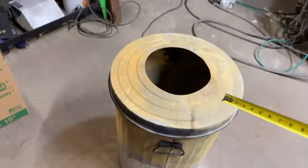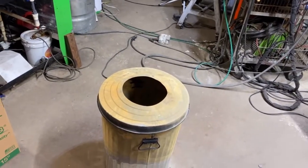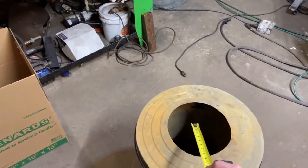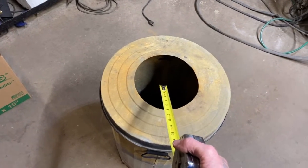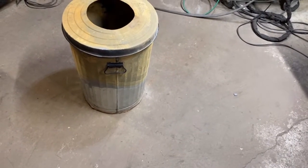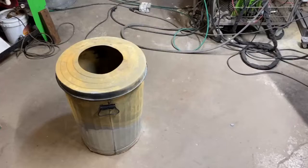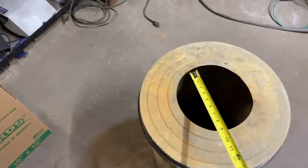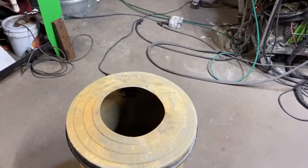The fireball only burns the diameter of this hole all the way down to the bottom of the combustion chamber. However, when I turned the fuel up and overran the system, we were able to get the fireball to burn inside, which would indicate that simply lowering or making the hole smaller would also do the same thing on less fuel. But that's going to cause problems — having a red-hot combustion chamber on the back of your setup will burn it up over time fairly quickly. With a stainless steel beer keg you'll be okay. The size of this hole right now is about eight and a half inches, and that is the exact diameter of the fireball that gave us six gallons an hour in our testing.